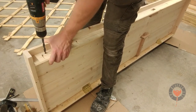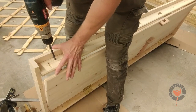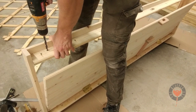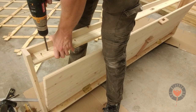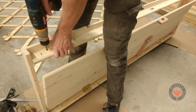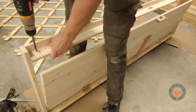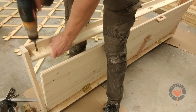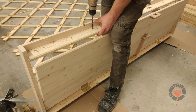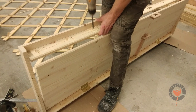Now that I've marked my holes I'm here to drill them out. Don't drill through the door that we just put — don't drill it. Again, we're using a 3/8 inch drill bit for that 1/8 inch jute cordage. Overall I had about eight holes for each door jamb — that's four pairs, and each pair was for one tie that went into the wall.